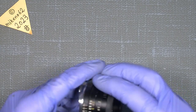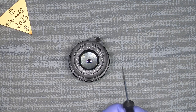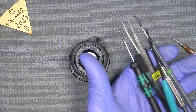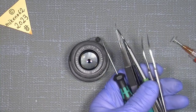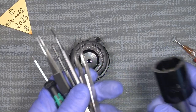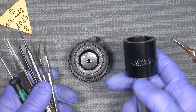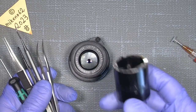Let's jump into it. We need a bunch of tools — at least some screwdrivers, straight and crosshead, a dentist tool, tweezers, and a special homemade wrench — a lens tool — that is really good for the retaining ring on this lens. I actually made it out of a 24mm high quality steel wrench, and there are two pins on it.